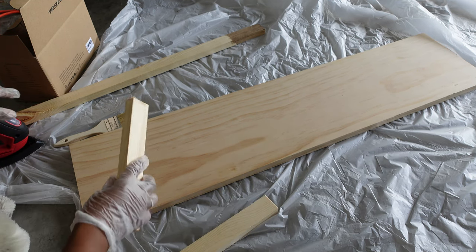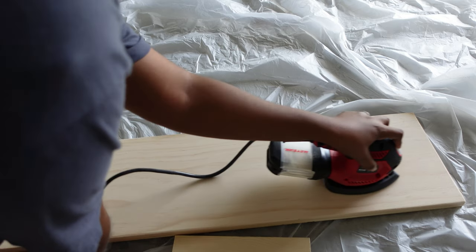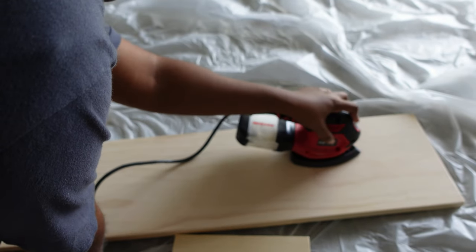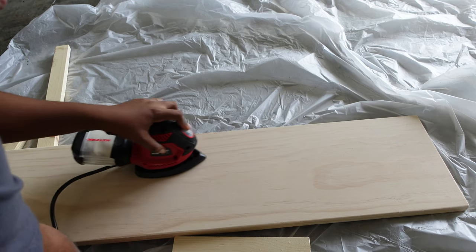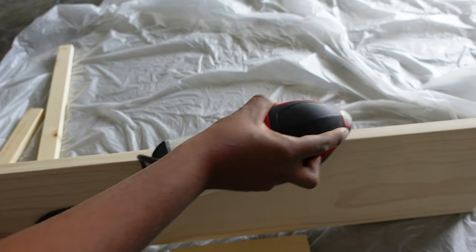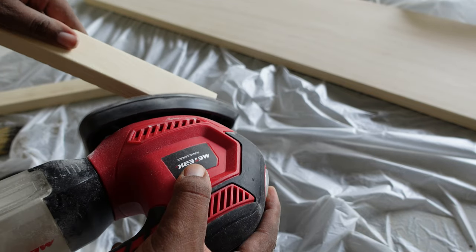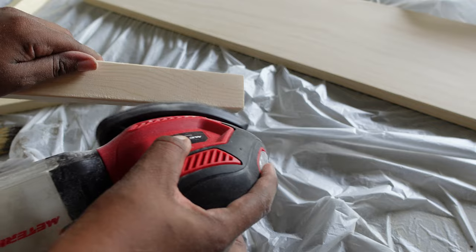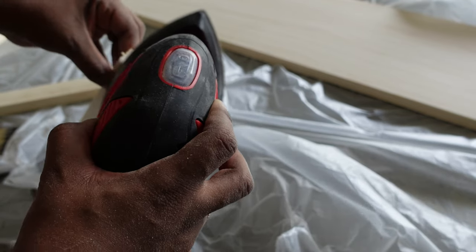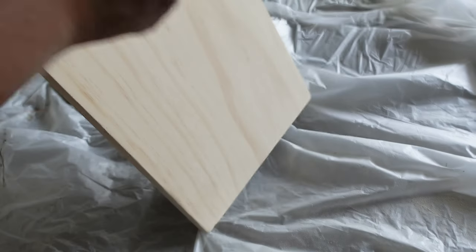I got some items from Amazon — all these items will be linked below. I began sanding with 120 grit sandpaper. There is a guide you can find on Pinterest regarding what sandpaper to use for different items. I used the 120 — I wasn't taking off any paint, I just wanted to refine the wood and bevel out the edges. You'll see that I am beveling out the edges on the main bath tray as well as the little stoppers. I went ahead and dusted off the wood pieces, making sure all the dust and residue from the sanding was removed.